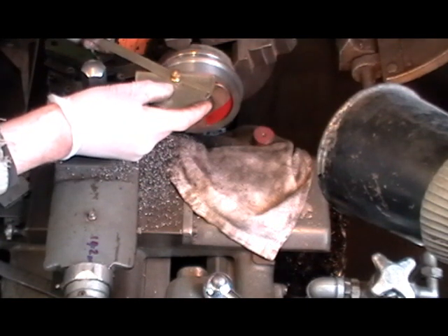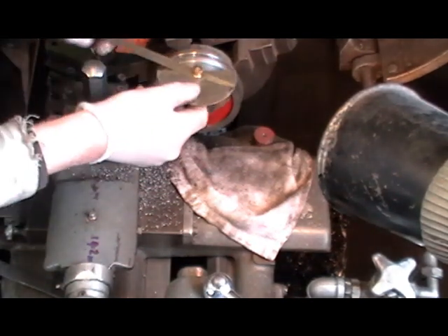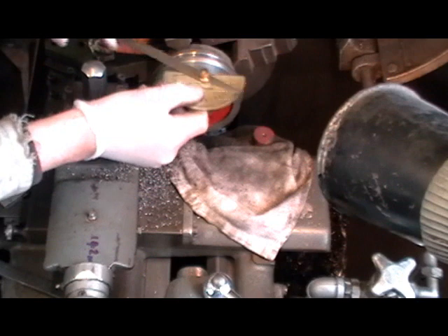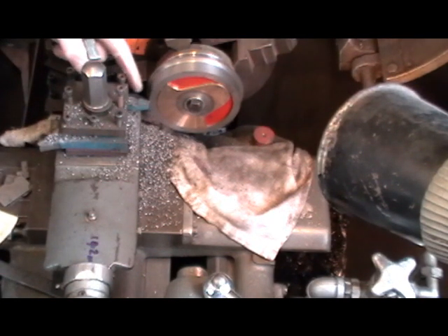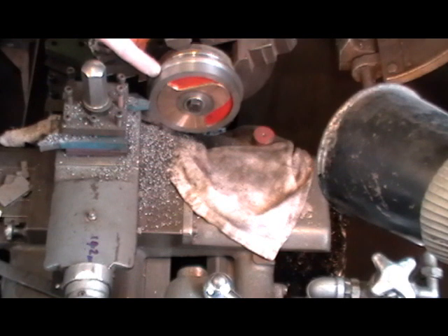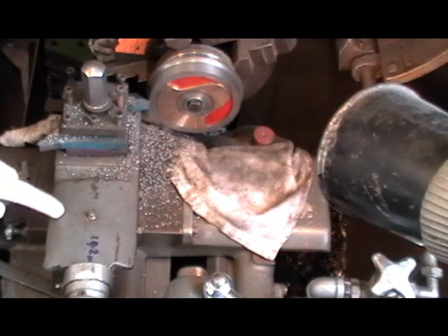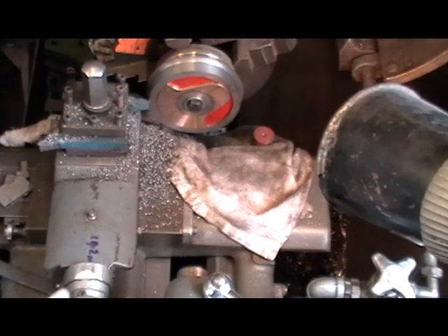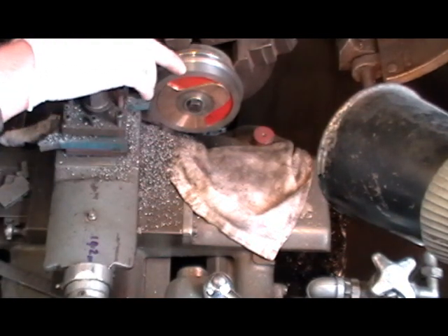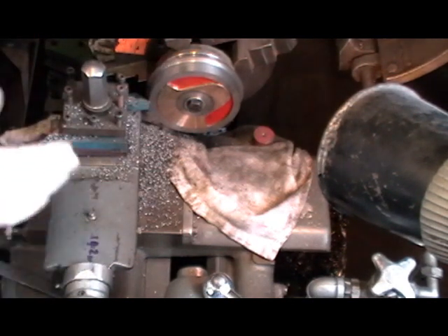I've got my protractor set at 20 degrees, set the protractor on the front face of my wheel, and I've lined the cutting edge of my tool with my protractor to get 20 degrees for this angle on my flange. I've got my radius set with my tool, and my tool set at 20 degrees to give me this angle. Before I set this tool over at 20 degrees, I set my compound slide at one and a half degrees, and I'll use my compound slide to machine the slight taper on the tread.